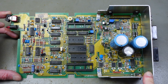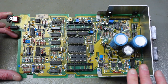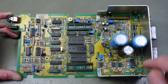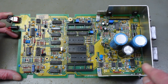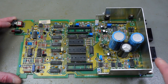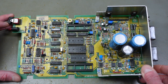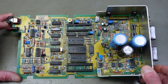I'm going to use 7805 and 7812S versions, which are regular linear voltage regulators. They are only rated at a higher amperage. So these are, I think, the standard ones rated at 1 or 1.5 amps, and I'm going to use the S variant, which is rated for 2 ampere, which technically doesn't really matter, but it is always good to have some headroom in case the motors jam or something like that and there is a large current surge, which might actually happen on these drives.